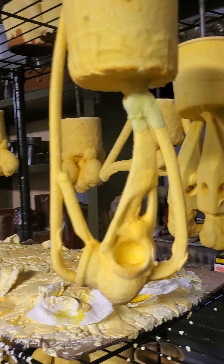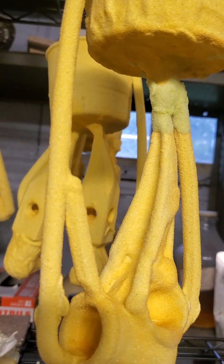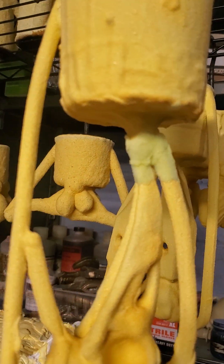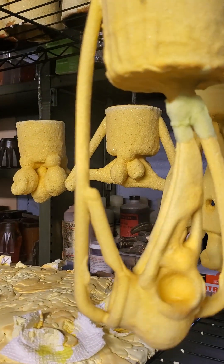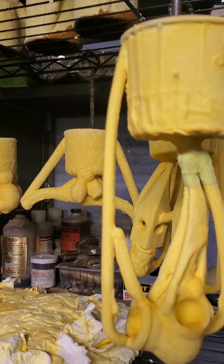This is actually a raven skull. It's got a little collared mount on a handle, and it's hollow underneath the beak as the skull would be. We've got tiny little connection points and a weird sprue coming down the outside to the backside, and then these are supposed to be vents going up to the outside of the cup where you won't see a pour.